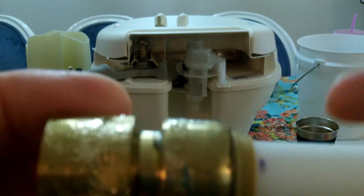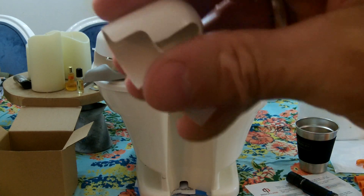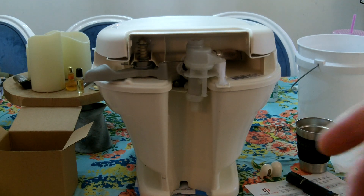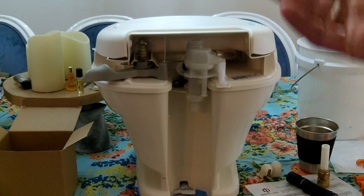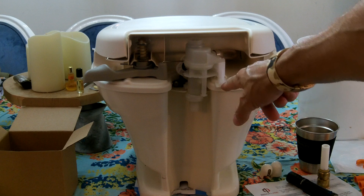When I put the new pipe in, I have to make sure they're all fully seated, then hook it up to the other end, refill the tank, turn on the water, and make sure the toilet is working. To take the toilet off, your standard procedure: take the caps off the bottom, use an adjustable wrench, get in there, and the toilet will lift right off just like a house toilet.